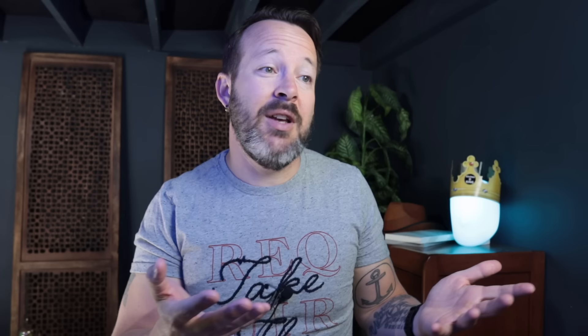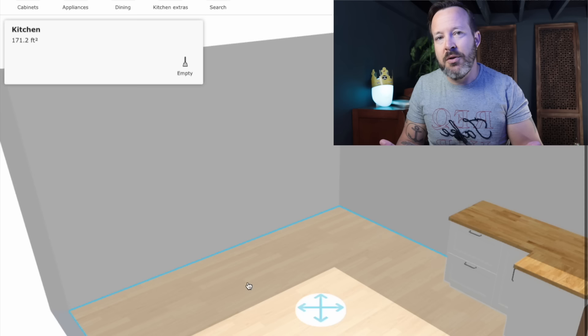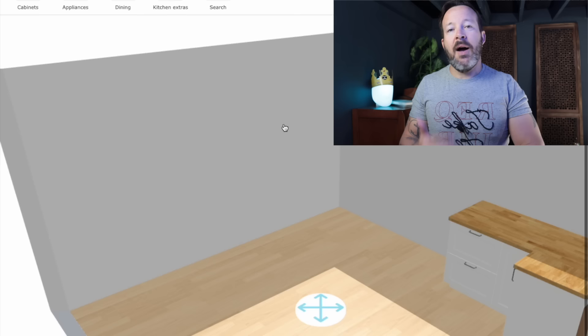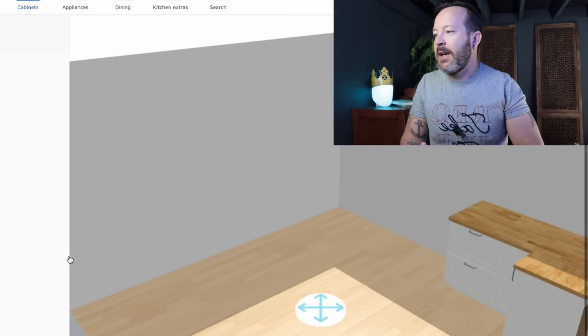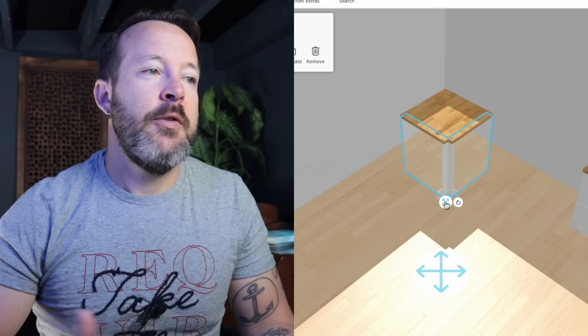For most people this is going to be fine. However, there are other ways to do base corners that might be of interest for your future renovation. My favorite way — and if you follow me you know I don't really like corner cabinets at all — is to block off base corners. While some people call me a little bit crazy for doing that, it can be a good solution in the right circumstance. IKEA has a great way to do this because they've already made a corner base filler that works perfectly for this scenario. Go to base cabinets, filler pieces and cover panels, and you have a freestanding filler piece for a base corner.